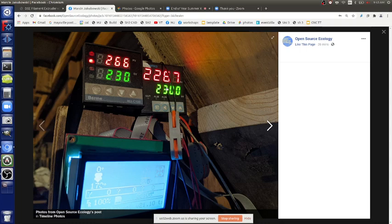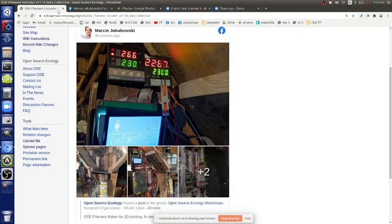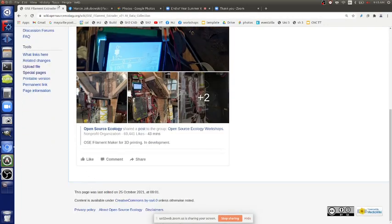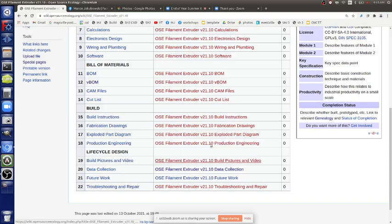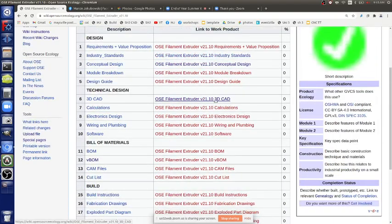There are just singular feedback loops for these two controllers. You would almost want the top one to somehow turn the bottom one off when it's too hot. But what I'm thinking is to change the parameters, see what happens if I put 200 degrees on the controller of the bottom one, and then try to take accurate measurements of the temperature inside at the bottom.